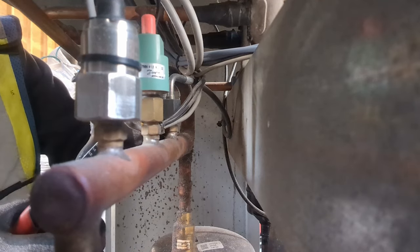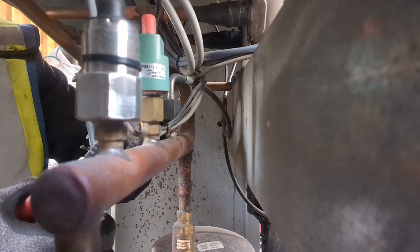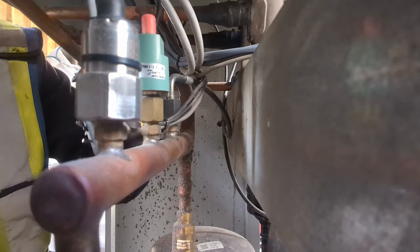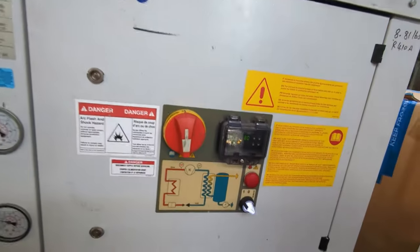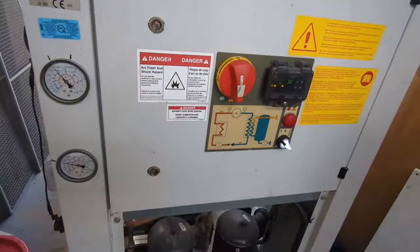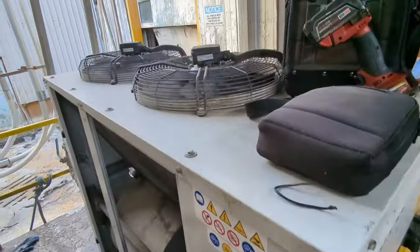In order to check out the rest of the system, we just bypassed that safety switch to make sure that everything else was running okay. And luckily, we had no other faults here. We had both condenser fan motors running, both compressors are running, pressures are good, coils clean, so we're good to go here.